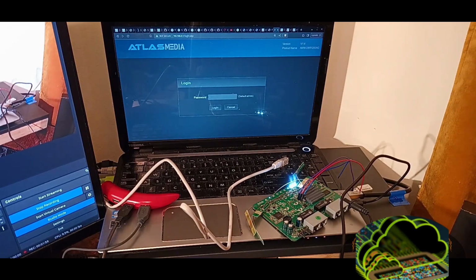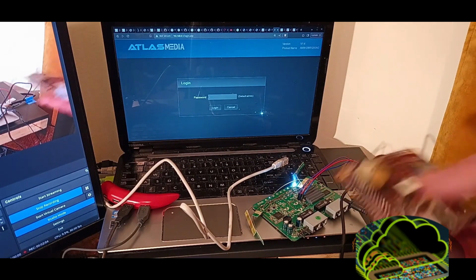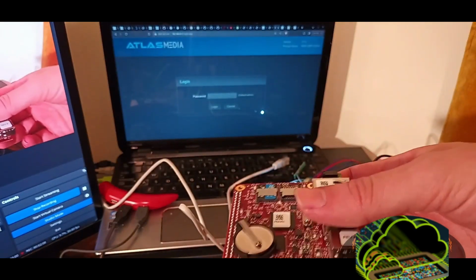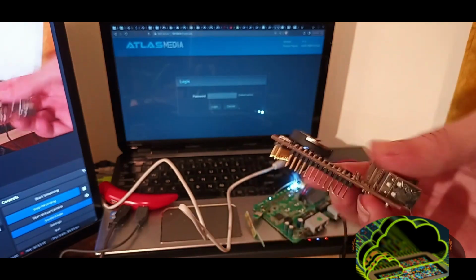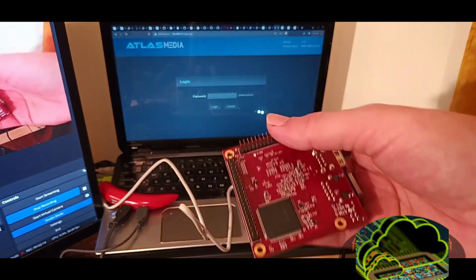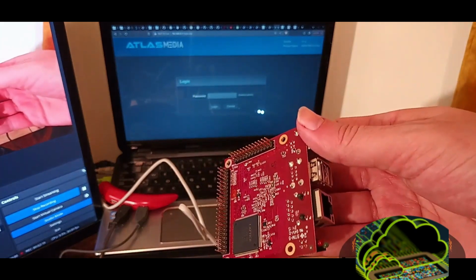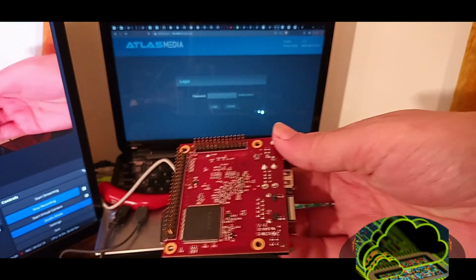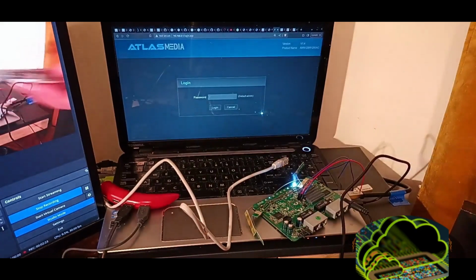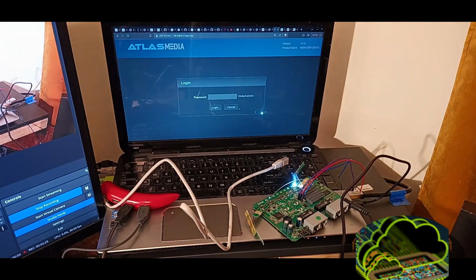Now, if you've ever played with a Raspberry Pi or an industrial ARM board like this, then you might be familiar with UART as a feature. A lot of times these boards will have exposed GPIO. Some of those pins will be UART, and it's a well-documented way for us to interact with these boards. Sometimes, these microcontrollers and different little boards might never even touch a network.